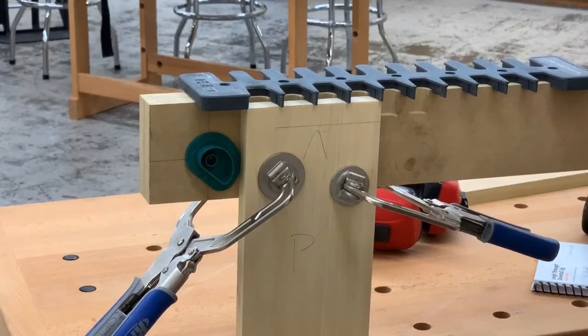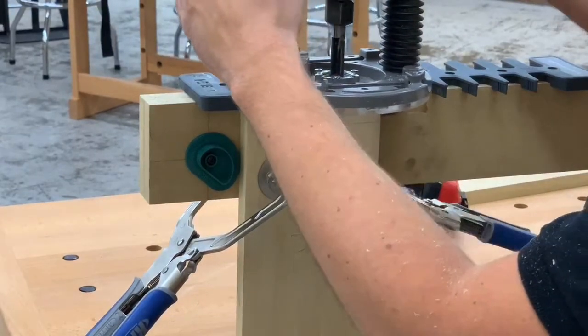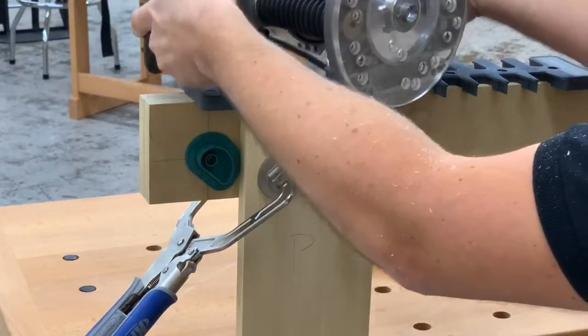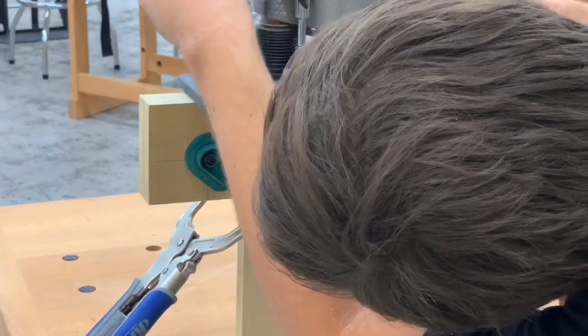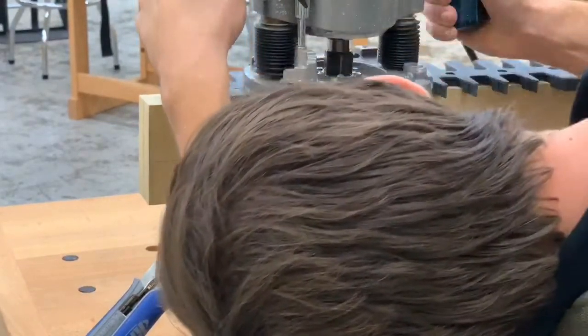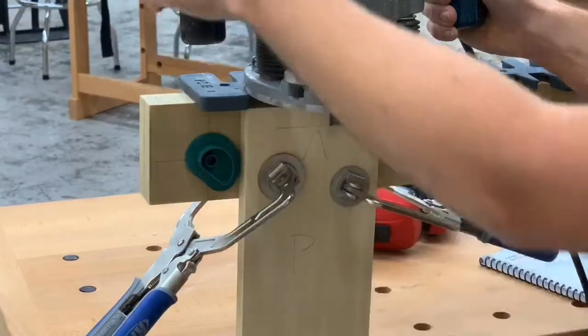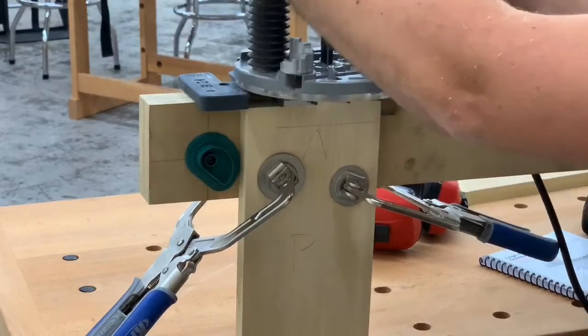On the pin side, because there is that notch in the template, the top of the pinboard will not be flush with the top of the beam — and that is fine, as long as it is touching the bottom side of the template. Take the tailboard and slide it up underneath to draw a line, then set your straight bit to that depth.